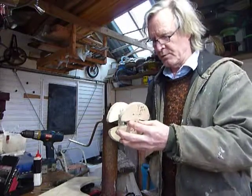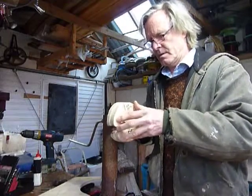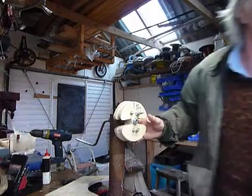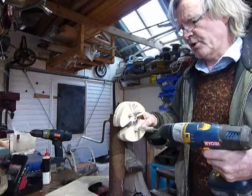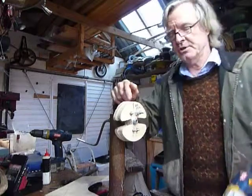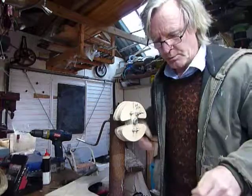I'm going to put it together now ready for winding the first coil, so I'll put this onto the machine and tighten up the nuts. You don't want to over-tighten them because you'll just distort the shape of the cheek pieces and have too small a gap. They do need to be snugged up because there's quite a bit of force pushing outwards when the coils get wound.